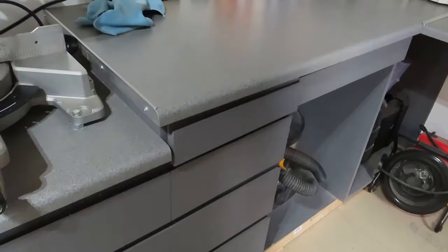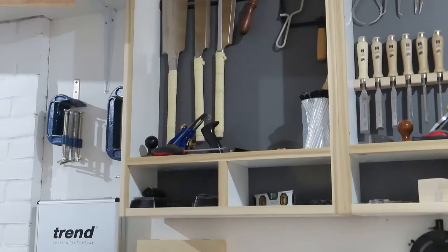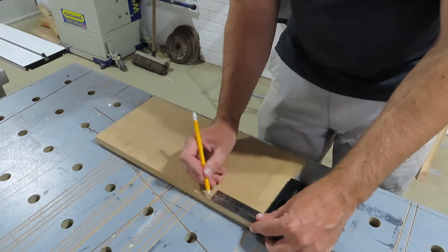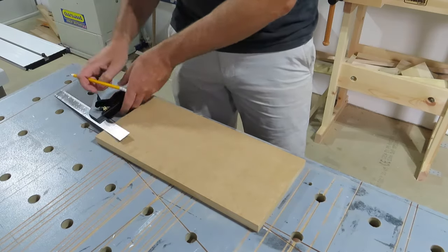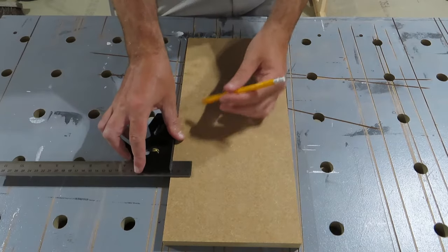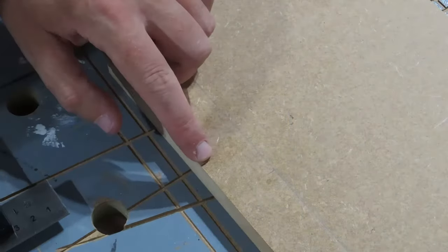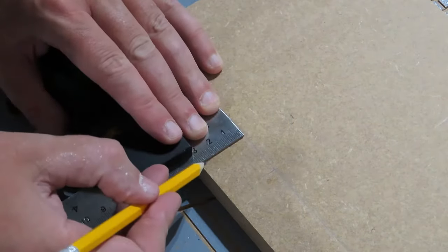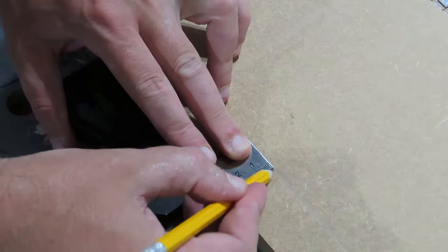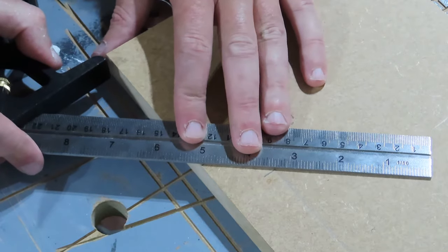So let's do some marking out for the first drawer front. I grab a pencil, then struggle to get a tape measure out of a little plastic pot. I work out by eye what I think would be a good location to do a cutaway for the panel, and then just mark it on either side. I then use it again to scribe a straight line for the bottom of the cutaway. Here's evidence of how incredibly lazy I am — I just use the width of the rule to mark a point on the top and bottom line, then draw a line between these two points, and in my opinion that forms the perfect angle for the side of the cutaway.